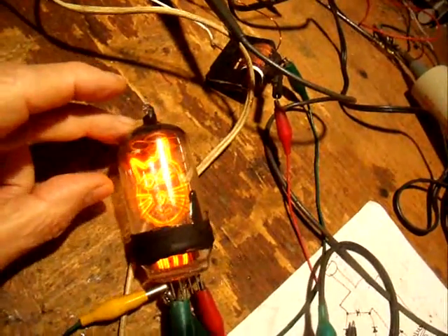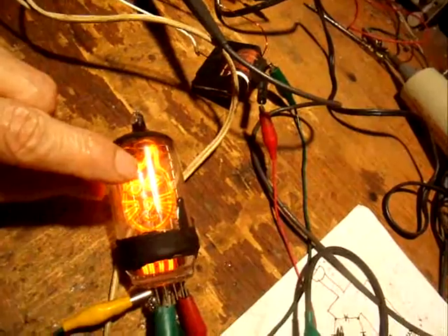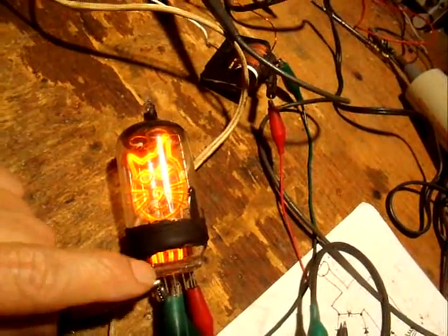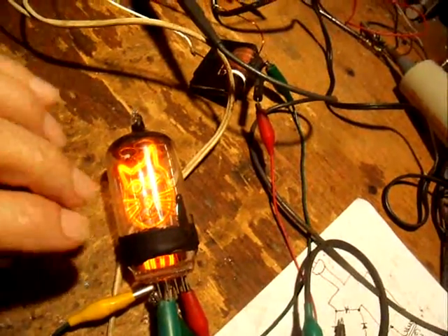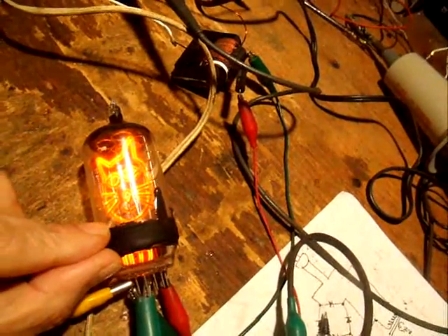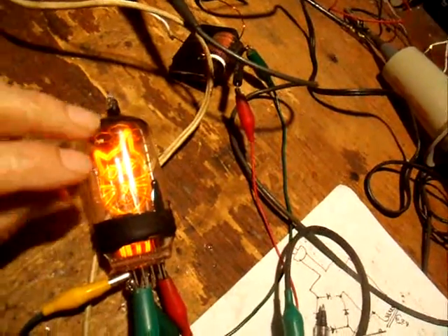What I'm going to do on another tube is make a Pyrex one out of Pyrex tubing, which is commonly available cheap, and join it onto the base, which is soft glass. But instead of overlapping like I did in the first one, I'm going to do the butt joint like I did on this one and see whether that will work. The epoxy has a small amount of flex and that will make up the difference between the expansion ratio of Pyrex and the soft glass — or at least I think it will.